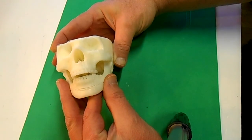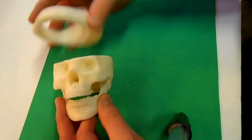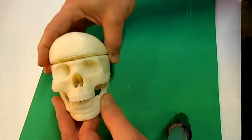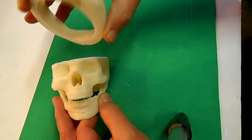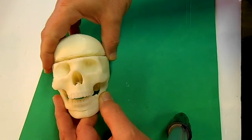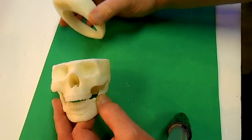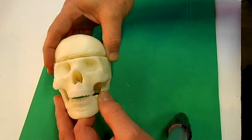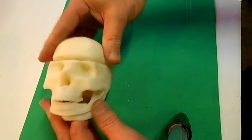I'm sure you guys who already have 3D printers know — let me know in the comments why this couldn't be done in one piece. I kind of see why they sliced it so you'd have a good flat end to put on the bed. I've got to use some sandpaper to make both pieces really flat. One mistake I made: I think I should have turned my heat bed down after the first or second pass to prevent warping, but that's all stuff that will work out easily.